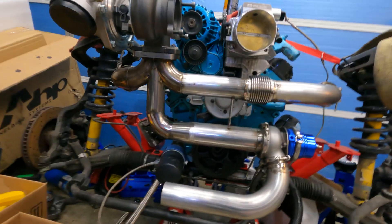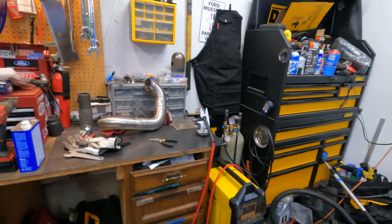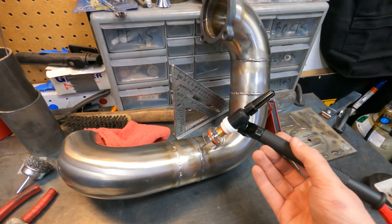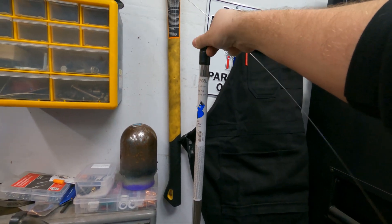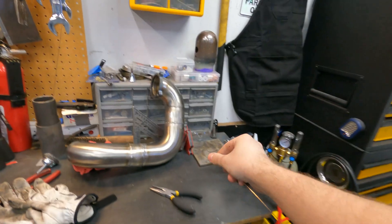It's all stainless steel and if you know anything about welding stainless, it's really susceptible to warping with a lot of heat. So the pulse feature on the Alpha TIG is really useful for preventing that. It basically turns on and then turns off, and while it's off you can move to your next spot — it just lets you stitch it together. I'm using some stainless filler here, ER308L, 0.045. Pretty good for welding exhaust.